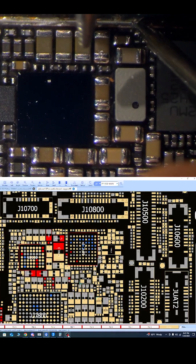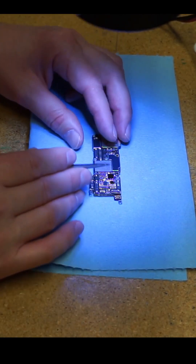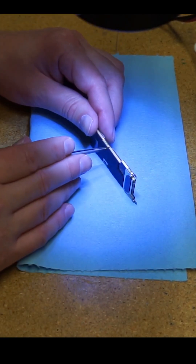I can use my multimeter to measure this capacitor at main and we can hear that it's beeping short, so this line is the problem. But the top of this board is pretty clean, so I'll have to split the layers to view the inner components.